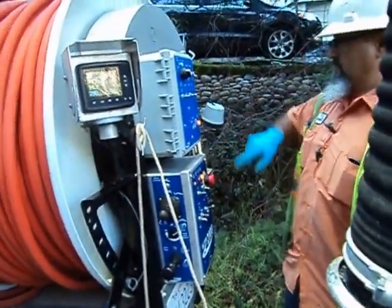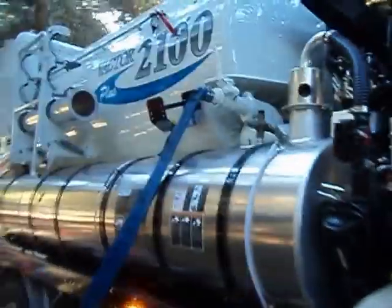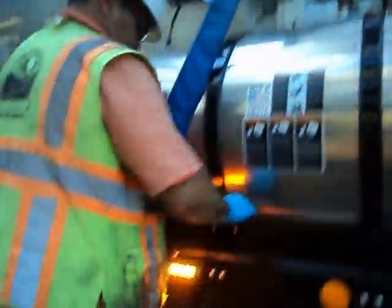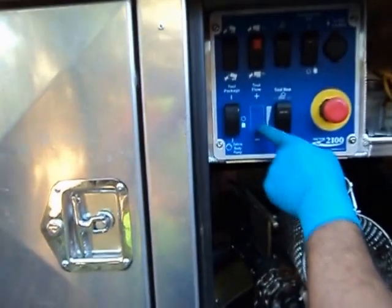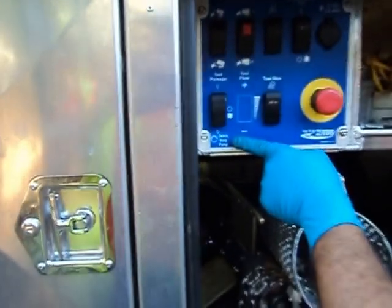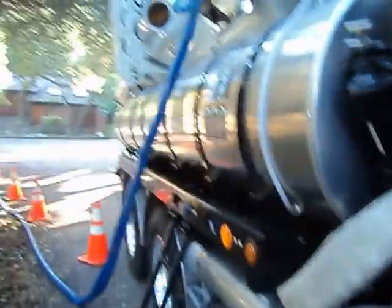The blower has to be off. Now we're going to come back to the trash pump, which is right up here. The valve is closed right now — open up that valve. Come back down and go into the side cabinet on the passenger side. The left-hand bottom switch has a home in the middle, and it says trash pump — debris trash pump on the bottom. To turn on the trash pump, you push that button down. That turns on the pump.